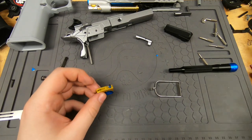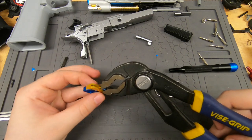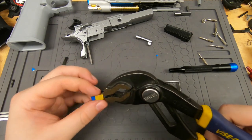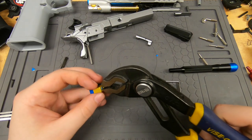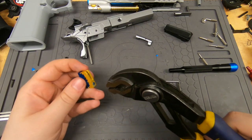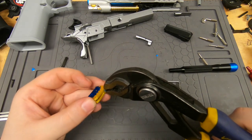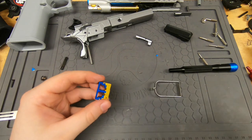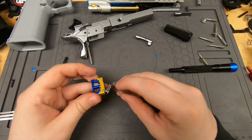You can use your pliers and just spin it in. If you don't have a two-piece trigger, you don't technically need this piece — it's for adjusting the minimum trigger pull. But if you have a two-piece, there's nothing else holding the two pieces together without it.